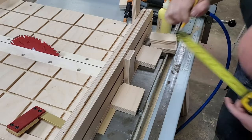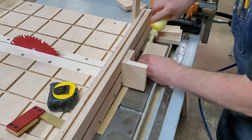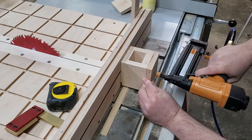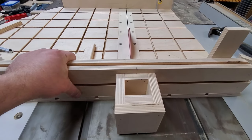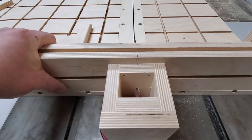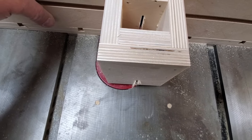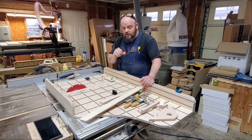You can see I'm just nailing that piece in, offsetting where I know the kerf will be. I definitely don't plan on using the dado with this — if I do need a dado, I'll certainly make a different sled to accommodate dado widths. For now, it'll just be my combo blade or my crosscut blade used in this. So let's make the first pass and kind of see what we look like here. The problem is when you're holding the camera you don't really pay much attention, so you just go ahead and cut all the way through. Well, that lesson learned there ruined my nice clean piece of plywood.